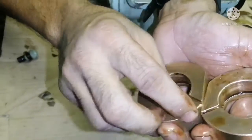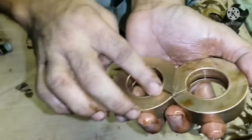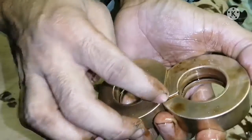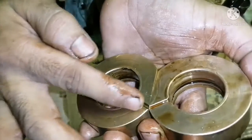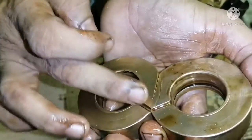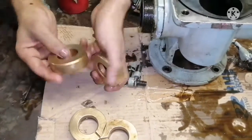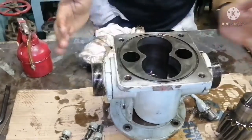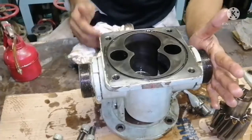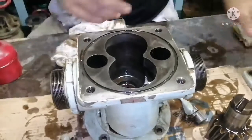This slot will always be on the suction side of the pump. What it does is it creates an oil pressure and gives oil towards your gear, so that suction for the gear will be easy — it gives a way to your gears. So this is your bush for the suction side and this is your bush for the discharge side, the top side. This is your discharge and this one is your suction side. Now, how can you tell which is suction and which is discharge?